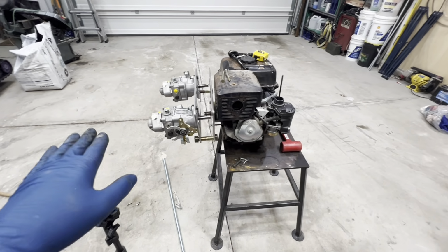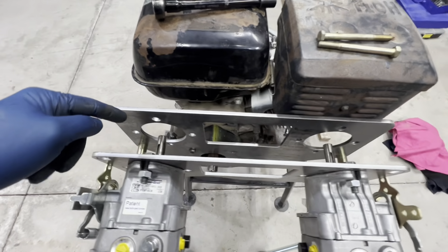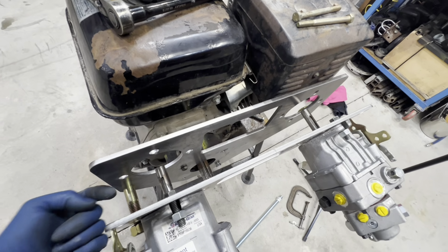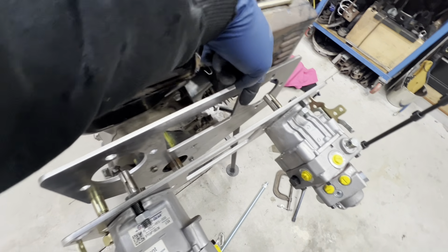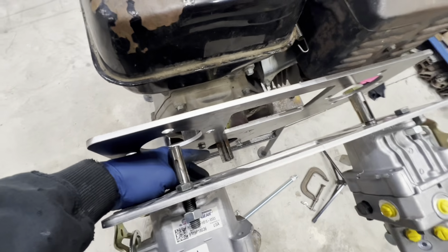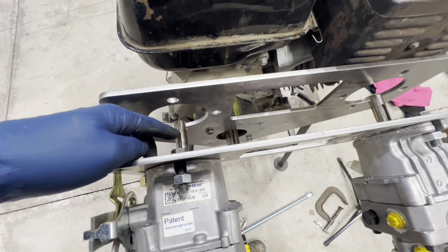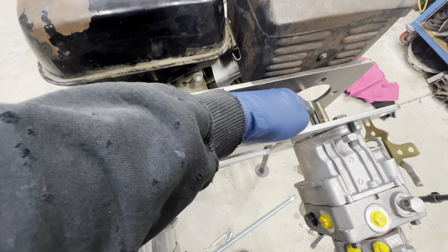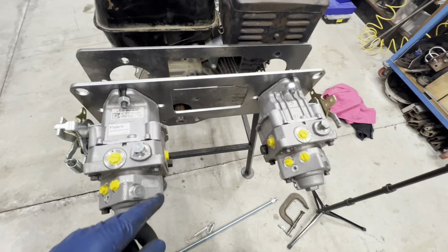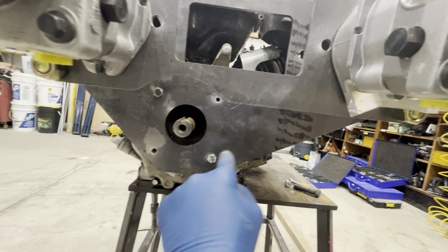It keeps everything in line. The other thing it does is, you've got to keep in mind that when the drive belt is running around the pulleys, it's getting pulled basically along in this direction. This, I guess you'd call it span or section of the belt here, this top one is under tension because it's coming back along here. And so the slack part, where you want to have your belt tensioner, needs to be somewhere along this section here.